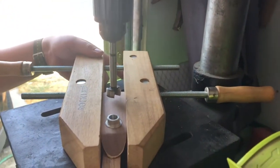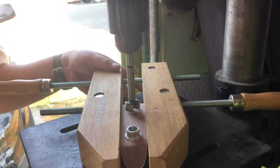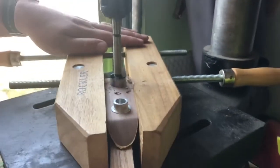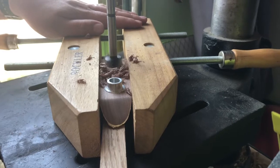The top section of the comb requires a 7/8 inch drill bit bored partway down, and then inside of that a 5/8 inch drill bit for the remainder of these stepped bushings which I'm installing now.